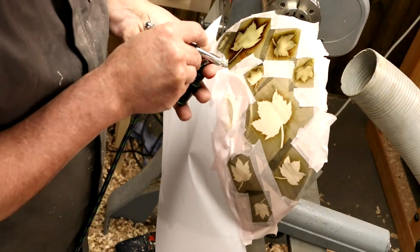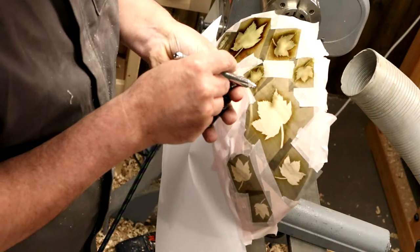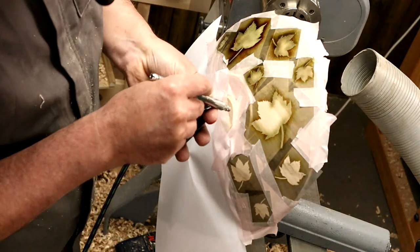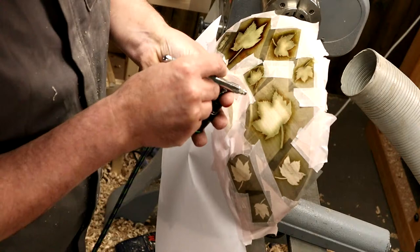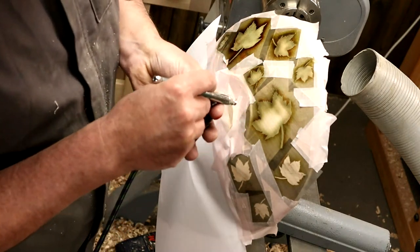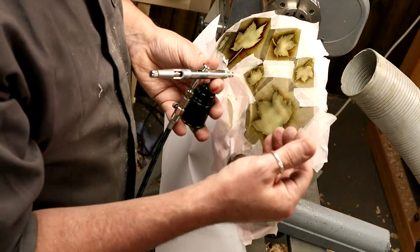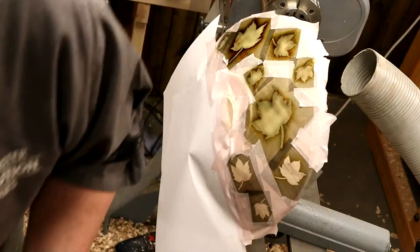First one from Chris. He's interested in the Nick Agar Viking bowl. Do you need an airbrush and compressor to apply the color? He doesn't have either. Could it be applied manually? Not really. No. The reason being the blend. What an airbrush gives you is a very soft blend. You will get hard edges from any color if you put it on without. And with the signature bowl, the sunset bowl, you've got three colors on there. You've got the yellow, the red, and the orange, as well as the black, of course. So you need that bleed.